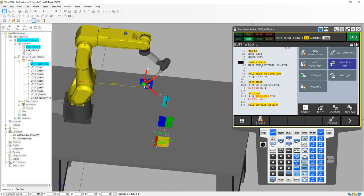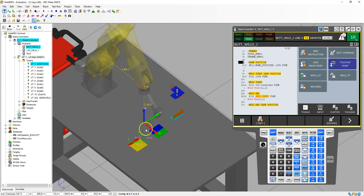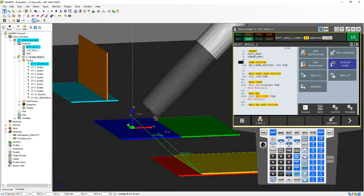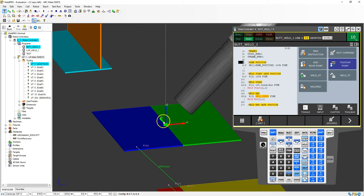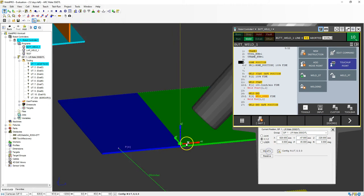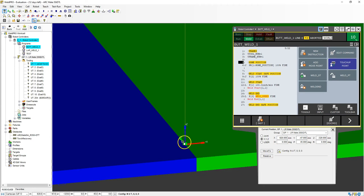I'm going to click the end of our tool. We're going to switch it from tool mode to world mode and bring it down close. The position should be a nice nominal number of 620. So now we should be directly on. Let's just move this over a slight bit more — let's go to negative 49. That should be good right there.